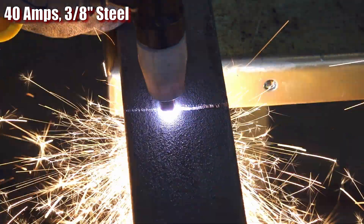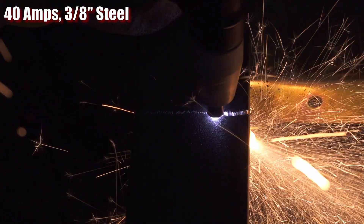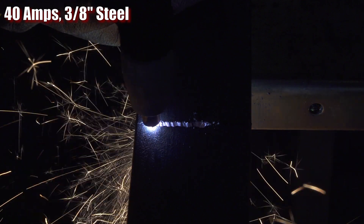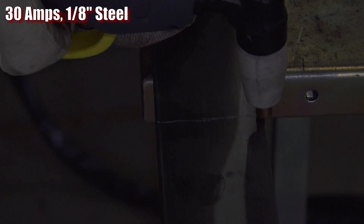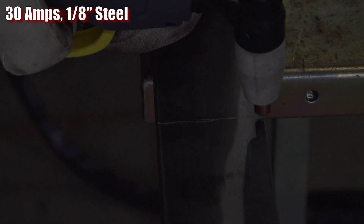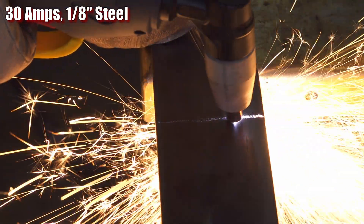When set at 40 amps, I had occasional trouble starting an arc — it was annoying when it happened, but it didn't happen all that often. However, the issue got worse when the amperage was set at 30 amps. It will pop and fail to start an arc, or sometimes the arc will start but then immediately pop back out. At that point, I had to wait for the post flow to stop because with the air flowing, it absolutely would not start an arc. At 20 amps the problem simply gets worse — the arc goes out more often and it often took multiple attempts just to get an arc started. It was actually pretty frustrating to plasma cut with this machine at 20 amps. If you want to do any delicate work or gouging, this really isn't a good machine for it.